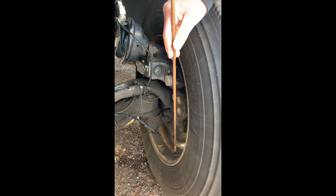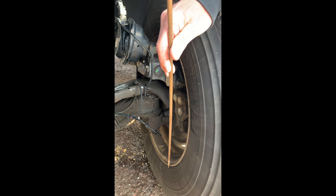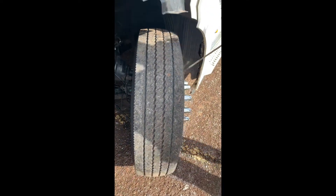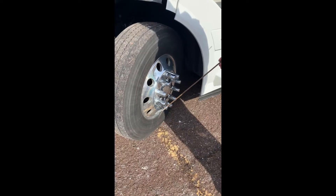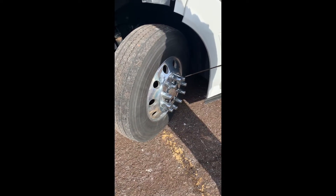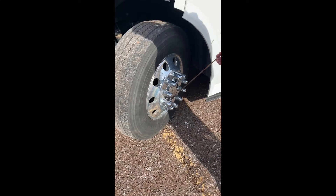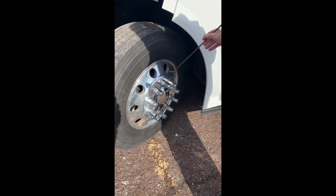The wheel itself, securely mounted, no extra holes or welds drilled in the wheel. The inside of my wheel is securely seated to the inside of my tire. The inside of my tire, there's no abrasions, bulges, or cuts, no audible leaks. The surface of my tire is worn evenly with a minimum of 4/32nds of an inch of tread depth. The outside of my tire is securely seated to the outside of my wheel. There's no abrasions, bulges, or cuts. All of my lug nuts are securely mounted, not bent, broken, or cracked, with no rust trails indicating a loose lug nut. My hub seal, securely mounted, not bent, broken, or cracked, no visual leaks. My valve stem, securely mounted, not bent, broken, or cracked — that's where I would check the inflation of the tire and inflate the tire.